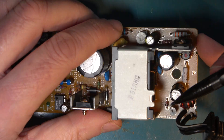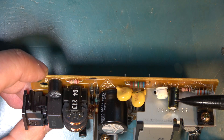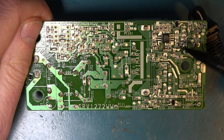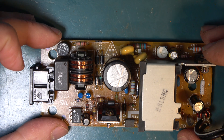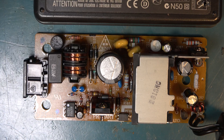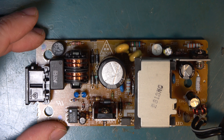There's a diode and another diode hiding in there which I've tested. So we know the problem is not caused by a capacitor, because the only bad capacitor has already been changed. We must have a fault somewhere deep in the electronics for which we do not have schematics, and it would take an age to reverse engineer all of this — in fact it's probably almost impossible. So I am somewhat at a loss. Also bear in mind that these are not particularly valuable; if I need to get hold of another one, they do turn up on eBay where people have had camcorders that have died. I think we've come to the end of how far we can go with this, which is a pity.